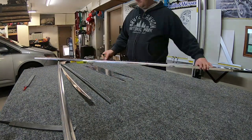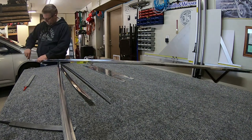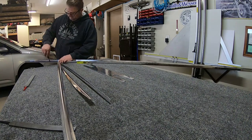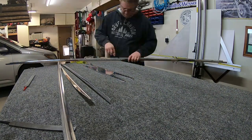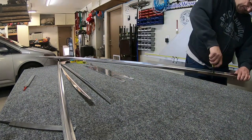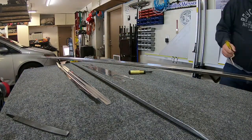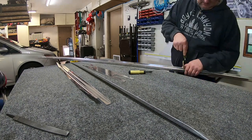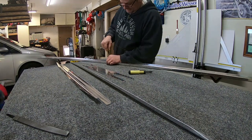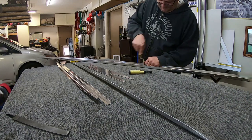That's one of the things I never really thought would be the case. I was like, oh, you get the parts, they're already stamped, they already got holes in them, you kind of put it together and you move on. But no, there's still a lot of prep involved. Even though they're cut right and they're drilled right, you still have to prep the material, make sure the holes are good, final size a lot of them in most cases, and make sure there's no burrs or anything like that. So a lot of prep work if you're going to build a plane.